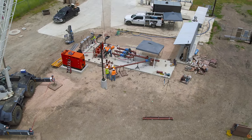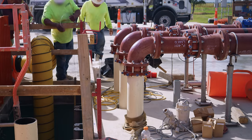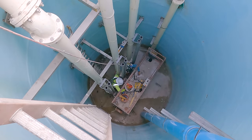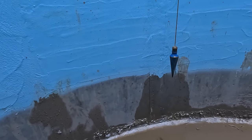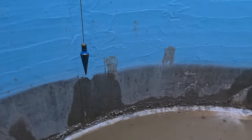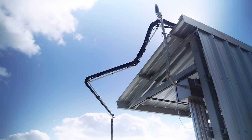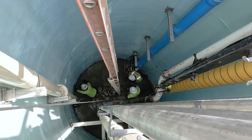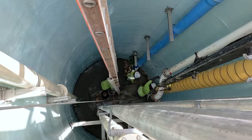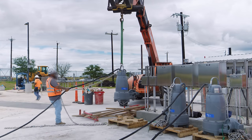All these pipes and fittings come together pretty quickly, but it'll be easiest to understand them if we go in order. I'll walk you through the whole assembly in a minute, but first I want to start with the pumps. Since the pumps will be installed near the center of the wet well, the outside corners could be an area where solids accumulate. The engineer specified that the bottom of the wet well be sloped toward the pumps in a bowl shape to make sure there are no stagnant areas where solids might settle out of suspension. A concrete pump arrives and gets set up, lowering a hose into the wet well. A finishing crew works to get the new bottom perfectly sloped, then the coating crew returns to finish the epoxy liner. Finally, it's time to put in the pumps.